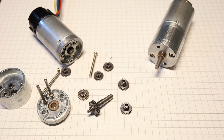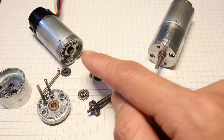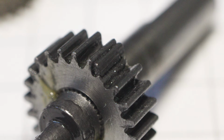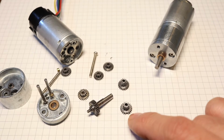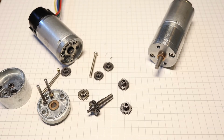And this motor came out of a rover that took too steep of a fall and landed on the front wheels, and this is one of the two front motors that have since broken. This assembly showed that 2 of the gears in the gearbox now have broken teeth, and that's why it didn't run smoothly anymore. And these teeth are far too small for most home makers to replace and fabricate. It's much too small for most 3D printers, even if it had the strength.